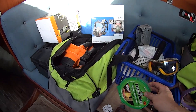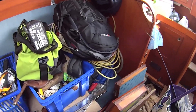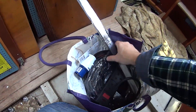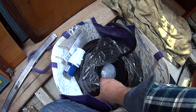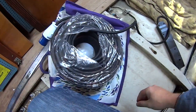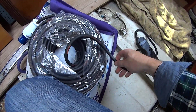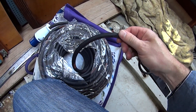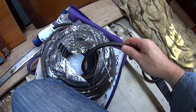I've got some tape. Now I've got some power, which is good. Should be able to run this out of the boat and get some power going. I just bought this, which is 50 meters of what they call pond cable — it's 3-core flex, 2.5 millimeter, with a heavy-duty rubber exterior, which means I can run it outside and if it's a bit wet out there, it should be fine.